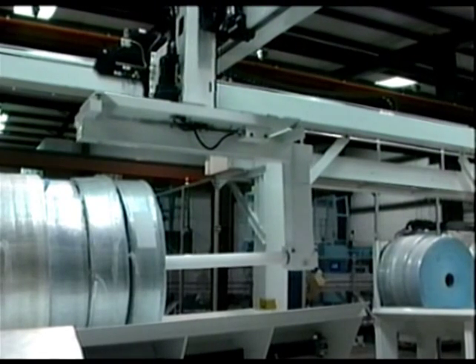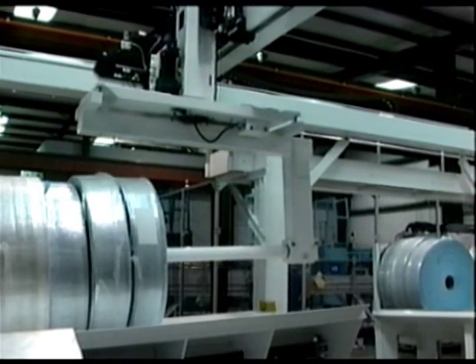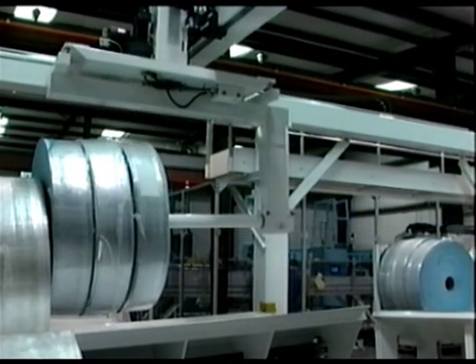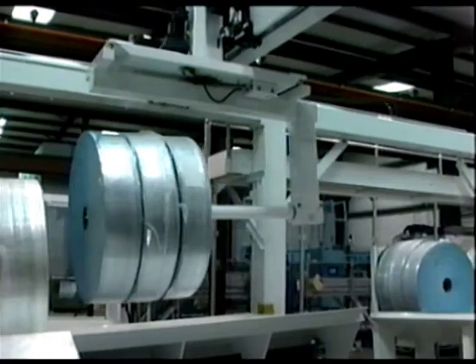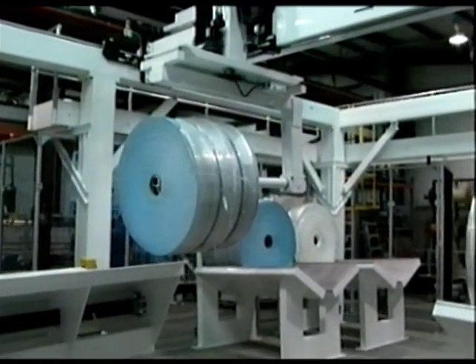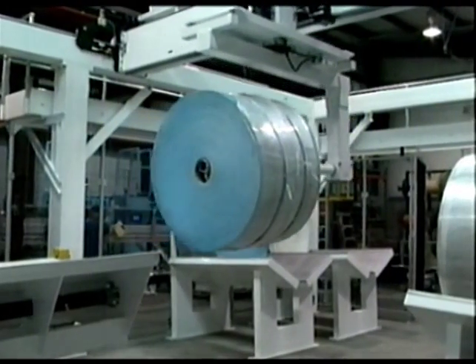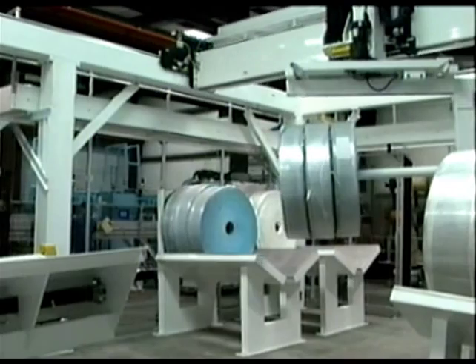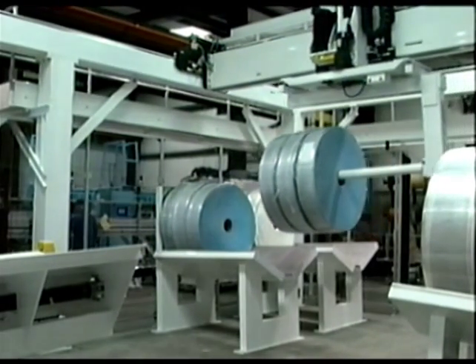One of the key features of some non-woven materials is a soft, spongy marshmallow feel to the rolls. This means sometimes the cores do not line up where you would expect them to be from their theoretical diameter. An innovative feature implemented into the SAGE end effector is a photo-eye capable of sensing the exact location of the core using a two-axis robot probe move.